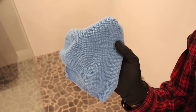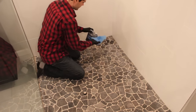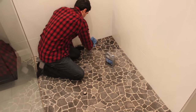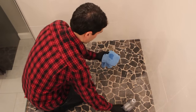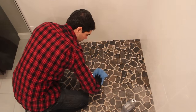I'm going to use a microfiber cloth to apply the Stone Enhancer to the tiles. I recommend starting in the corner of your shower and pouring a little bit of the Stone Enhancer on your microfiber cloth, then working your way outward from there. You don't need to spread too much — just about a quarter size in volume — and then work your way out of the shower.